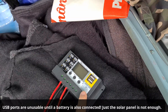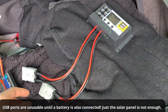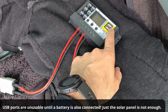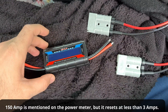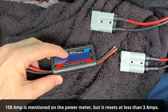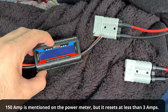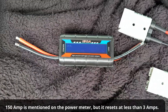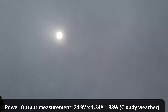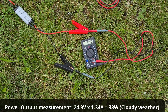Although this charge controller has USB outputs, I cannot connect the solar panel here and get those 5 volts for charging a phone, because there is no battery connected. So without a battery you cannot use your solar panel and you cannot charge through those USBs. This mentions 150 amps up here, but I gave 2-something amps at 24 volts and it was already resetting itself — so from 2 amps to 150 there's a large gap. These are not too powerful at all: 150 amps but at which voltage? 1 volt? 0.1 volt? Currently it gives 25 volts and there is no direct sunshine — it's very cloudy.